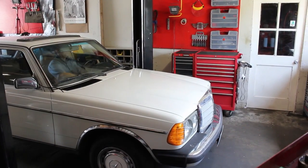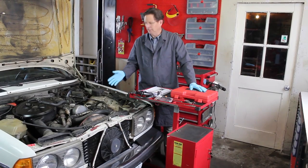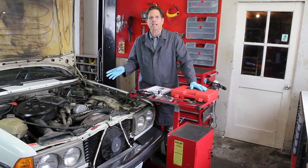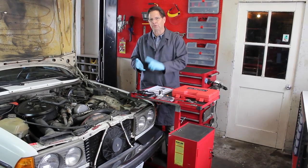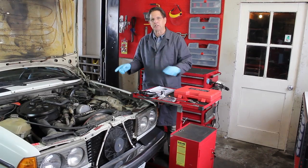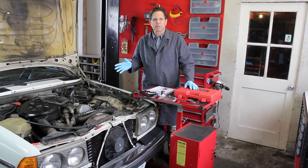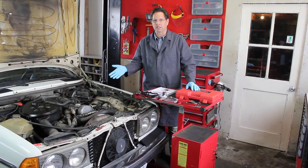When dealing with any type of diesel engine performance problem, you have to start with the basics. These diesel engines require very high compression to run properly. That means starting, performance, fuel economy, power, all these things come back to engine compression. It's kind of like compression's the heart of this engine. So you have to start with a compression test.